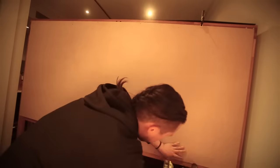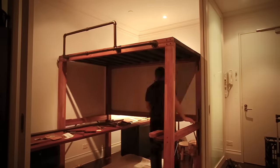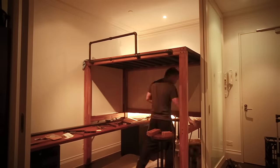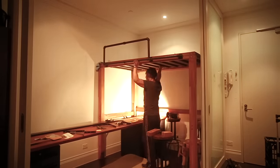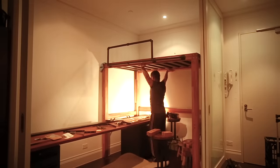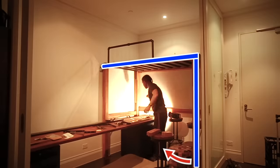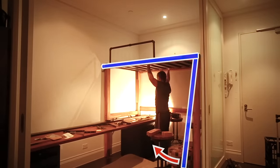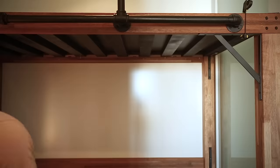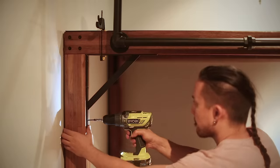I wasn't happy with the stability of the structure, so instead of more triangles I thought I'd place one large piece of plywood on the entire rear face above the middle beam and fasten it to the frame at multiple points. This should prevent any further left-right shearing and make the whole structure feel a lot more stable - and that was certainly a success. Moving the bed felt like moving one solid piece of furniture. The only remaining weak points were the front legs, so I attached two final triangle brackets to the front face to prevent any crowbar action on the top corner joints.